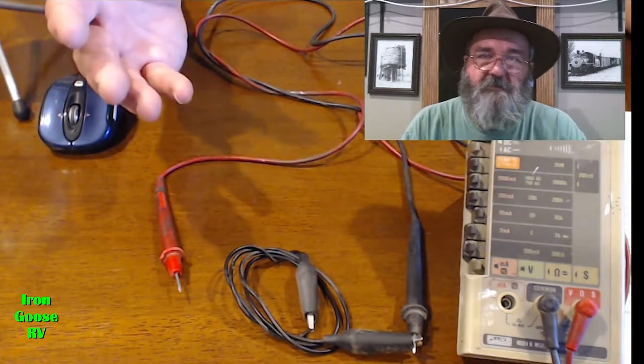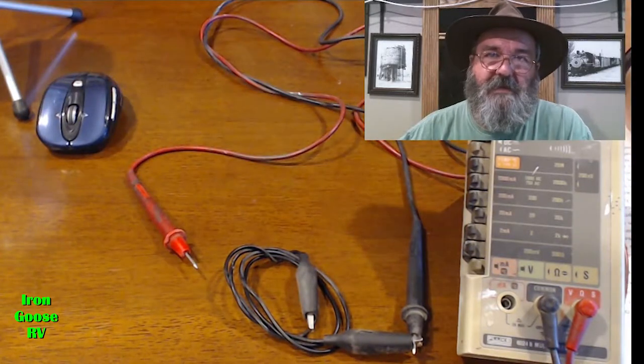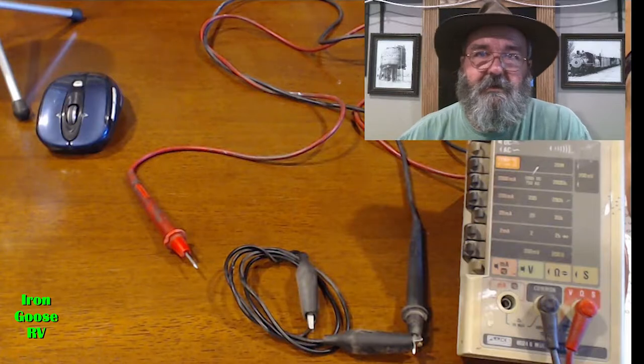It's a safety valve. Now, if you did not have a fuse in each circuit, the only limit to excessive current flow in that particular circuit would be the wire itself. And in a short circuit situation, you could possibly and probably have a fire if you didn't have a fuse. Fuses are safety devices. This is why you always replace a bad or blown fuse with one of the same rating. Now, I've said that probably 4 times during the presentation, but it's extremely important.